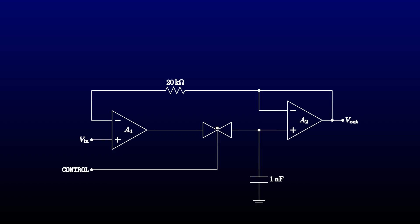When the switch is closed, the circuit output and the charge on the capacitor both mirror the input. When the switch is open, the output buffer sees only the voltage on the capacitor, and the output stays unchanged, just as it did with the peak detector. This circuit has some of the same problems as the peak detector, so let's fix those before we breadboard it.